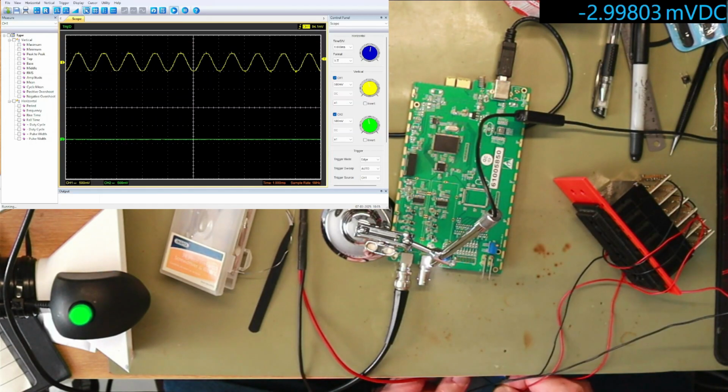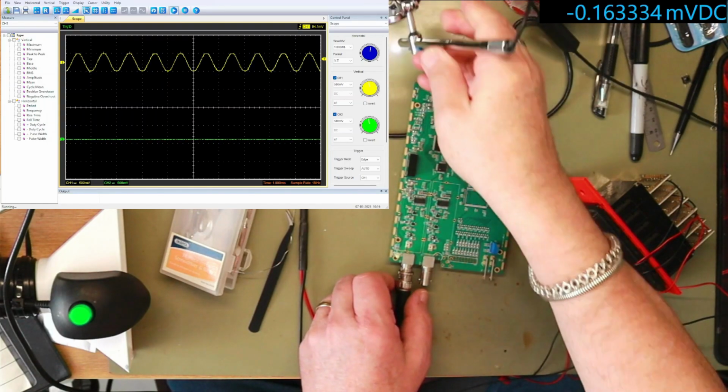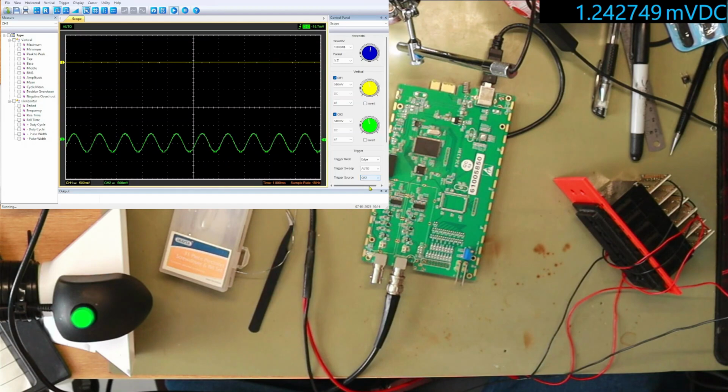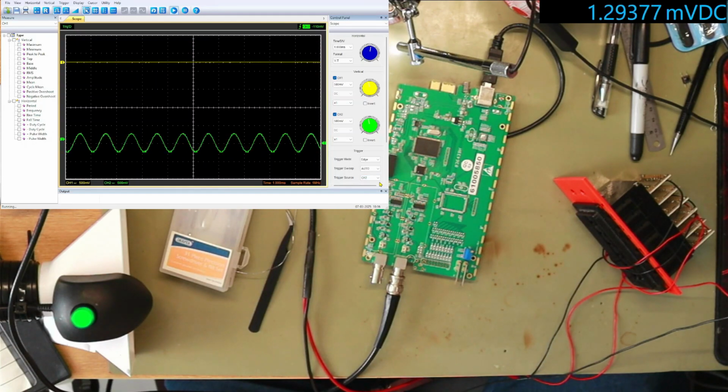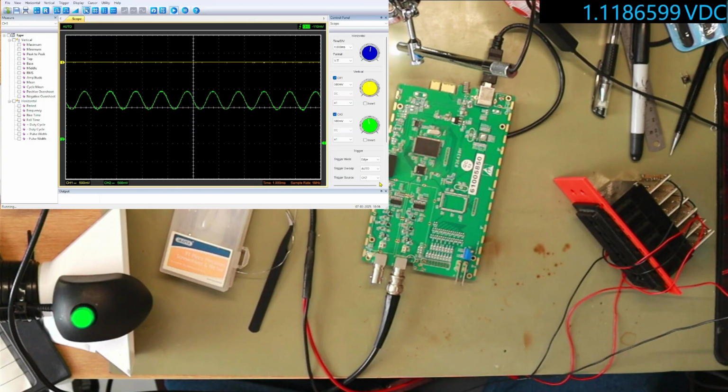Right, let's connect it. Alright, so now you can see we have the same settings on the scope, and we've got 0 volts on the input, and we'll whack it up to 1 volt. There you go, over 1 volt, and the sine wave hasn't moved. Put it back down to 0. Get rid of that, that's a pain in the bum. Oops. Put that into there. Trigger it on 2, so it's stationary. And now we'll wind up to 1 volt again. And there's the difference.